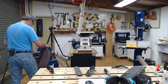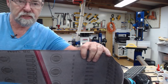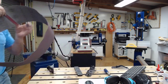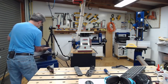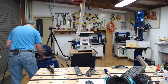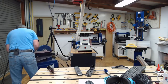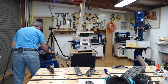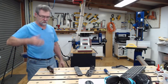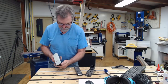Again, with the arrows the right direction. You can see the joint. See that joint? That tape gives it no extra thickness. Nothing to speak of. Here we go. If you've got a small belt sander, this is probably not a good idea because those belts normally do have a join in them that will leave a witness. Ka-dunk, ka-dunk, ka-dunk. All right. Oh, that's beautiful. Absolutely beautiful.